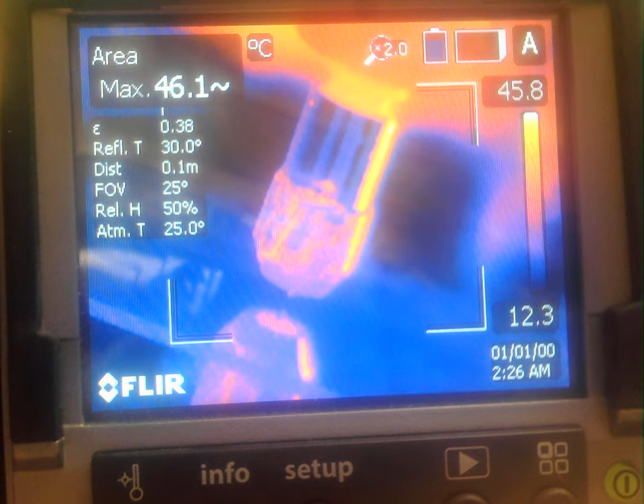We are working at 30,000 RPM at a feed rate of 15 millimeters per minute, traveling 10 millimeters on the substrate and 0.125 millimeters in the z-axis. So with no further ado, I'm going to turn the spindle on and start the deposition.